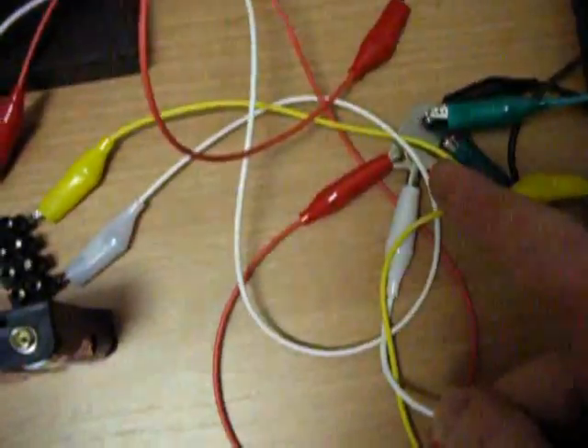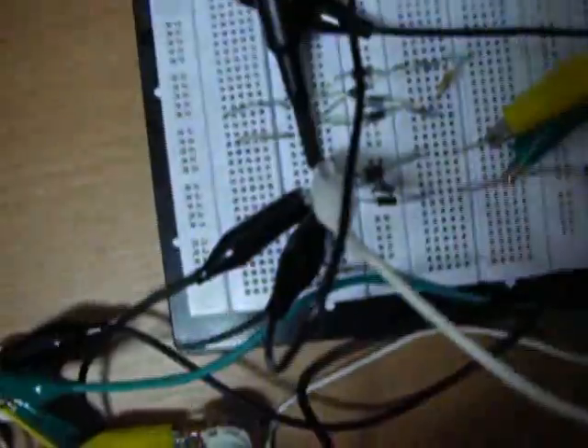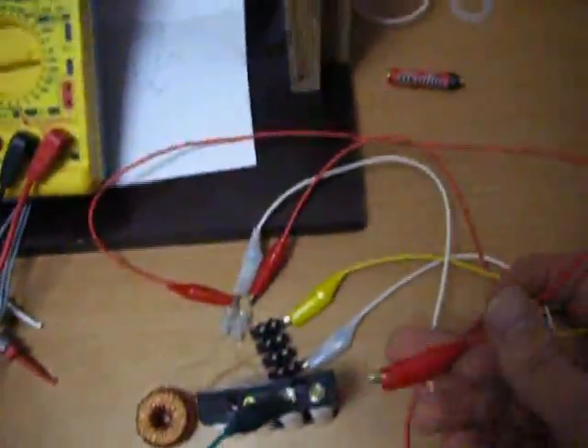Okay, and that's the AC signal I get from the Joule Thief output. You will see it's all about the tuning. This is my 1K pot — number 2355 — I use this pot to slightly adjust the frequency. Here's a bridge rectifier I'm going to use today to get my cap charged. Let's hook it up.